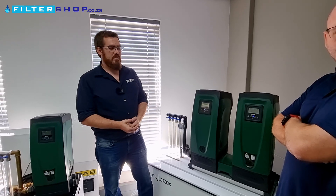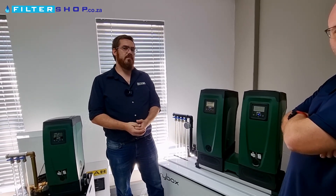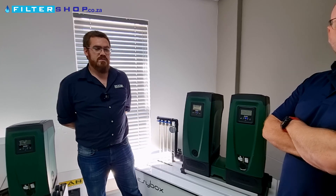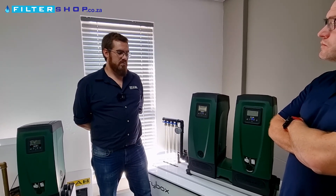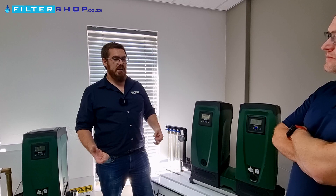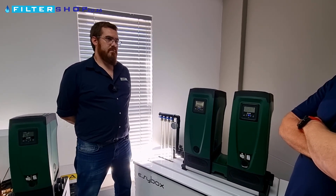Three to four meters okay. For something like this with quite a high flow rate, what pipe size should you be running? Any constriction on the suction side will dramatically decrease performance. If you're going to be priming you definitely want to go 40mm, and if you're really trying to push it you'd want to go even bigger, possibly 50mm pipe.